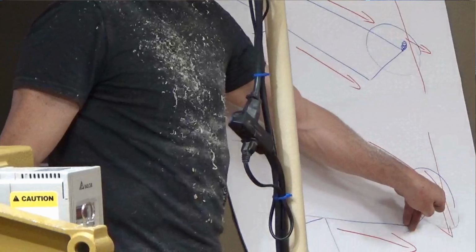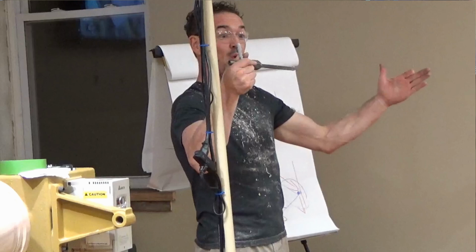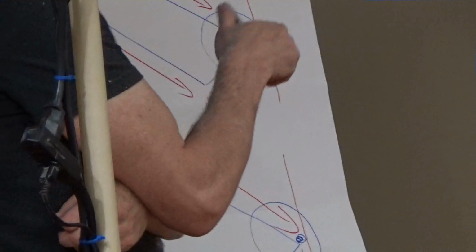I just took a really sharp chisel with a big furry burr that I put on the coarsest, bounciest wheel in the whole room, and it did nothing but abrade the surface. If I had taken this little chisel here, which is a conventional scraper, this one is just flat on top, and it's half the width, and I put a burr on it, and I put it into that end grain, everybody in this room would have got a piece of that bowl instantaneously. It would have instantaneously gone, ooh, burr, parallel surface, smash, got right through the side, blown into pieces. That's the difference. Negative rake, when you put a secondary angle on.